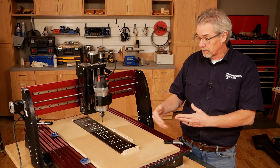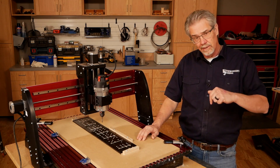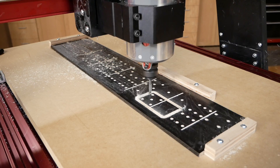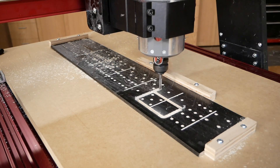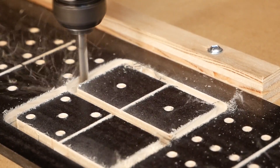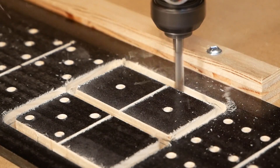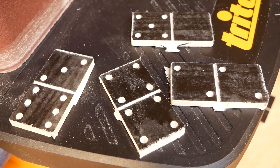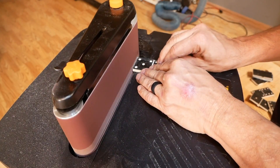With the holes and the divider lines cut, now we're moving to the cutout stage. We're going to use a quarter-inch down-spiral finishing bit as it was recommended to us. The program leaves small tabs on each tile to keep them from flying loose during the cutting operation, so a bit of touch-up sanding is important, but it's quick and easy to do.